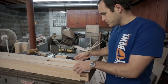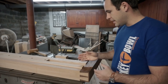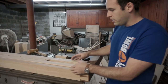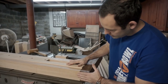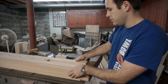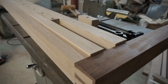Couple of the problems that I was running into as I was putting this section here with the wagon vise in it. I just glued these up here, these three sections here. I didn't want to glue it all together because I didn't feel like I could get it all squared up with the dovetails. So I decided to do the dovetail separate. I'd glue these up, and once I got this all squared up, I'd be able to glue it to this piece then.